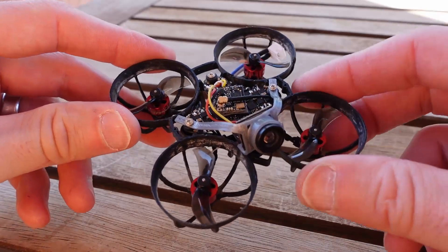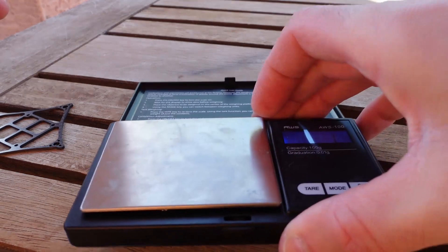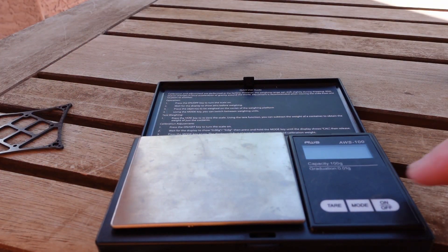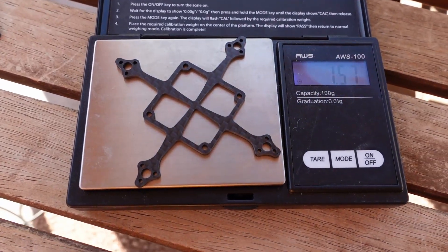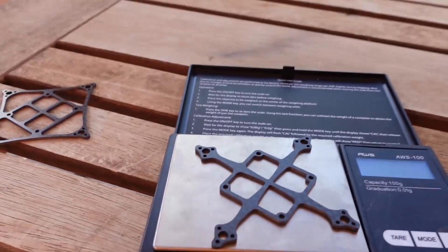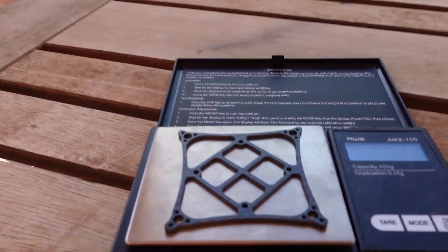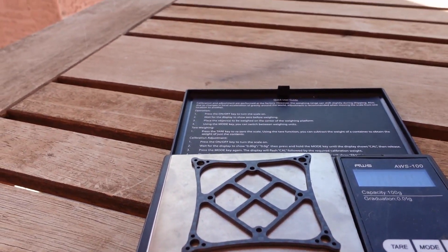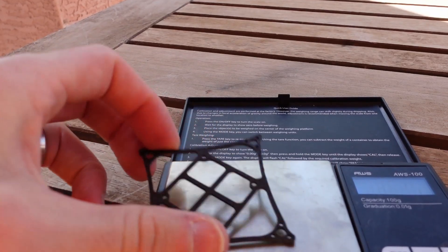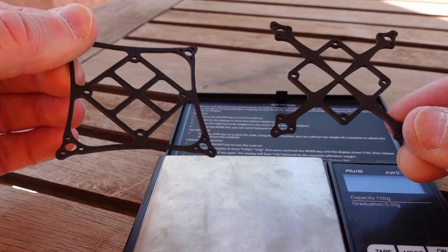Time to put these in the air. Let me check the weight on these frames. The traditional frame is coming in at 1.57g. I intentionally designed these and tested them with a couple of printings to get the weights close — the box frame comes in at 1.62g. So the box frame is just a tiny bit heavier, but realistically that's within the margin of error — these two are effectively the same weight, using the same amount of material.